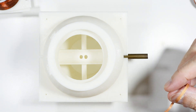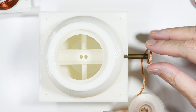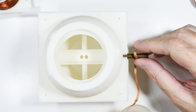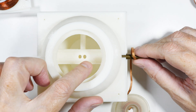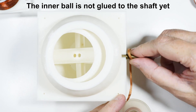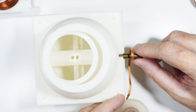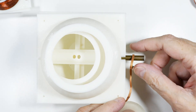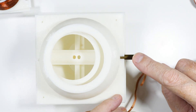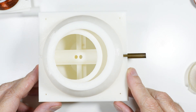Westinghouse's solution was to use a coil of flexible wire. What I've got for my model is solder wick — you just attach it to the shaft like this and to the outer coil wire. Because the variometer only has to rotate 180 degrees, you can handle it simply with a coil of flexible wire that moves like that. I'm debating which approach to use; I could do one on each side. The tabs are to mount whatever I'm going to use to connect the shaft to the outer shell coil.